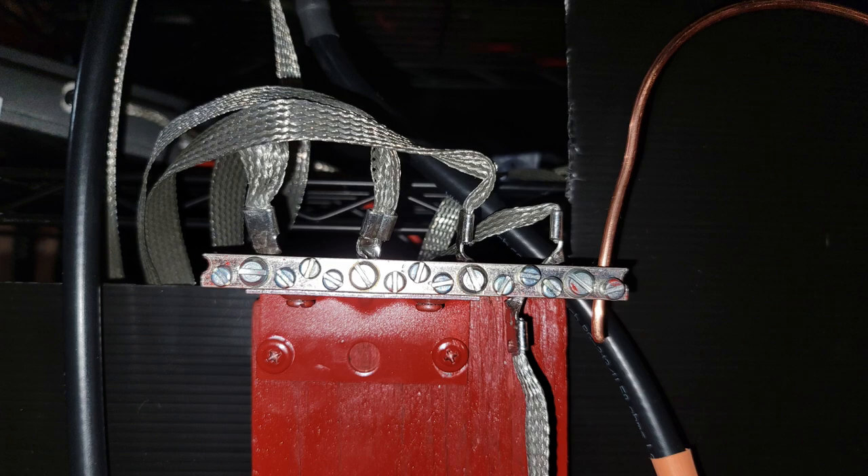One of the things — and you'll see this in a number of shots — you don't want to put hard 90-degree turns in your copper as you route that out and down into your grounding rods. I've tried to make sure and avoid that as I routed this 8-gauge copper. High-power electricity does not like to go around 90-degree bends, so just be careful and try not to put hard 90-degree bends into the copper.